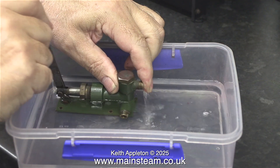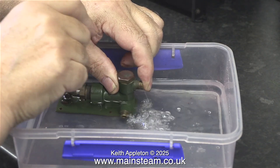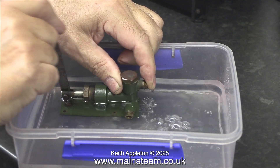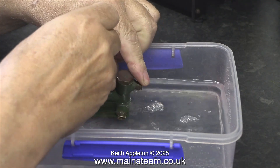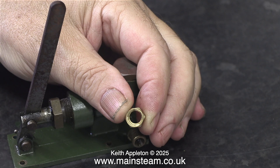The red cross means caution and this is a serious caution. This pump is capable of pumping extremely high pressures, so you don't want to do what I'm doing here. Don't put your finger tightly over the end. The worst case scenario is you could pump some water through your skin into your finger, which is not what you want to do. The good news is the mechanical aspect of this pump is fine.